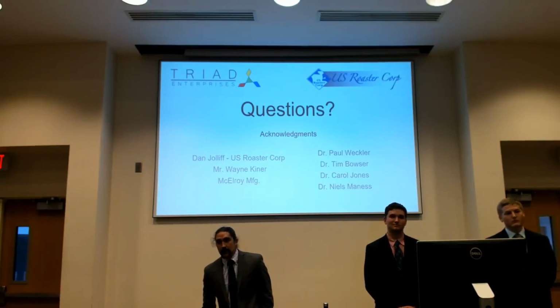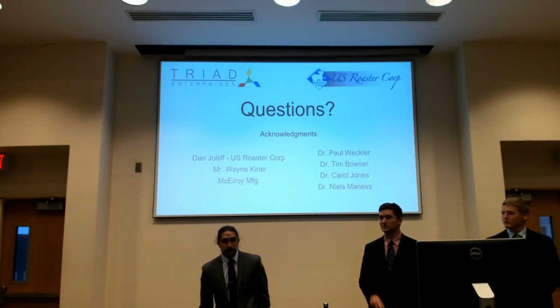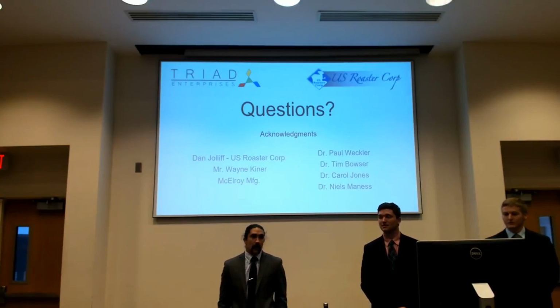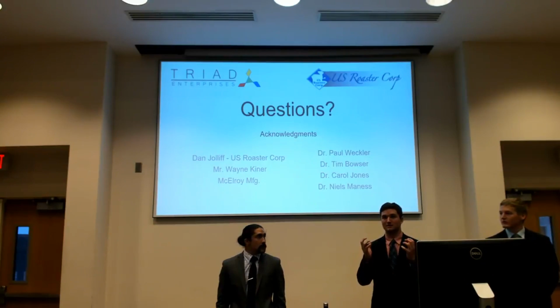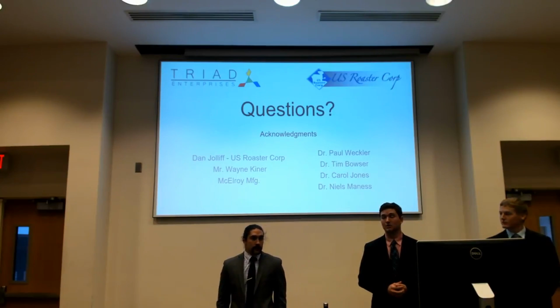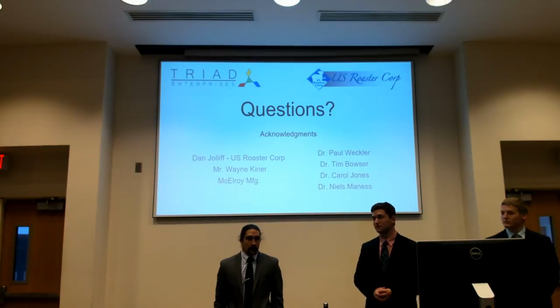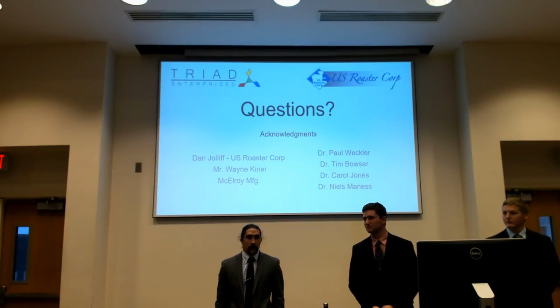How do coffee beans differ from cocoa beans? Coffee beans are a lot harder overall. Cocoa beans are a lot softer, and also they have a lot higher fat content. So when you do crush them, we always have the issue of maybe getting some of that fat out and collecting on the rollers, collecting throughout the system. As I understand it, we don't see that as much with coffee beans. But that's probably the main difference that I would suggest.